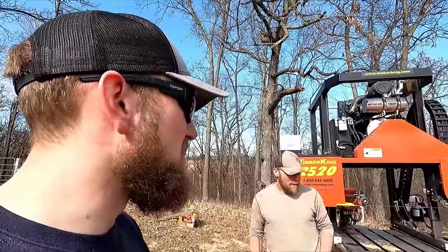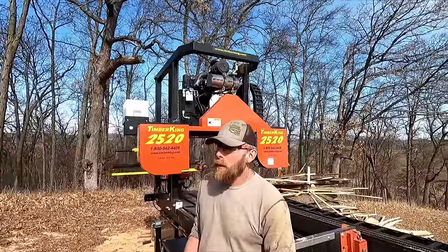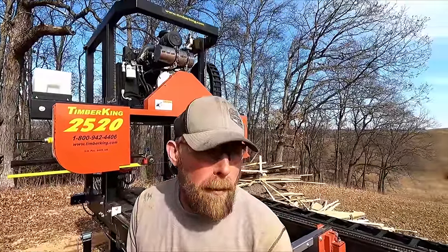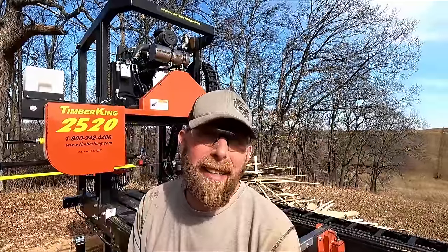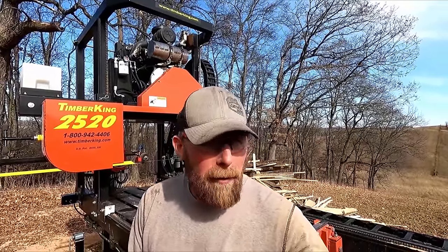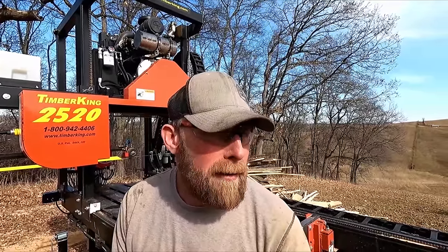This would be the true work hours now. Yeah, so this is all veneer lumber, so we have to be careful, be very consistent. They've even told me to be careful about the wane, because it doesn't matter how nice the log was, they're going to dock you on that stuff. A little bit of wane, which is a little bark on some edges here and there. I've done furniture stuff before. Typically, if they strip that all up in the flooring or that type of stuff, a lot of times that ends up being wasted anyway.